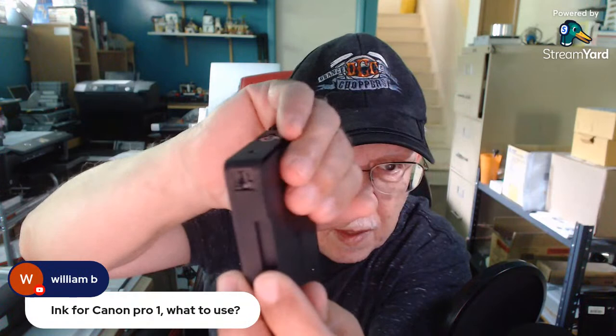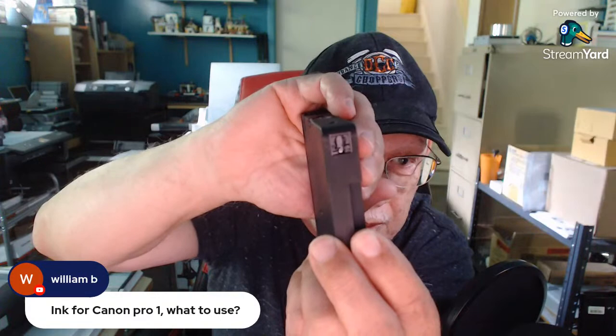You can see that I carved out a circular little space there. That's because the single-use chips, unlike these OEM chips, have a little ball of resin. It's a little dome. All single-use Chinese chips are that way, and they just won't sit flat. So I have to machine those.